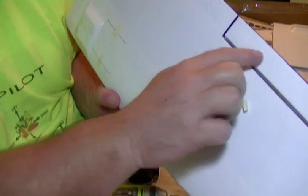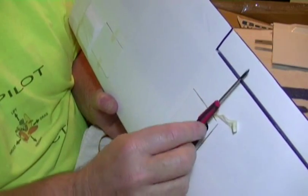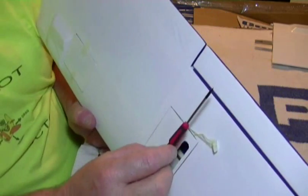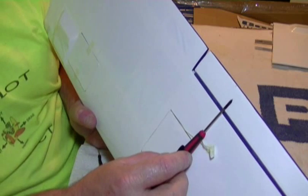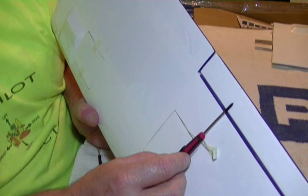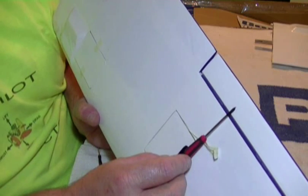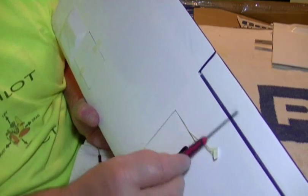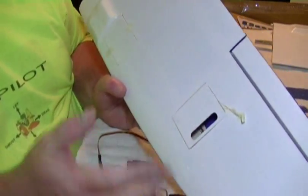The aileron is made out of solid stock, so I can bolt anywhere. I'm going to rotate this — that will put my control horn a little bit farther over toward center. On this little bitty aileron it probably won't matter too much, but I want to try to get it closer to center because of flutter. So I've changed that from what the book showed.